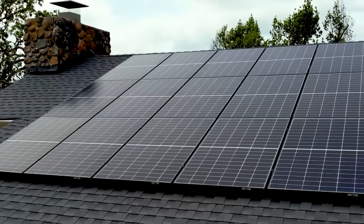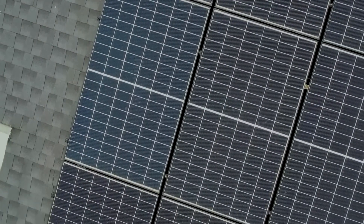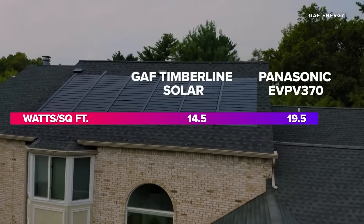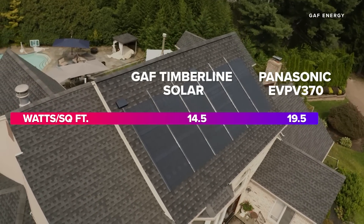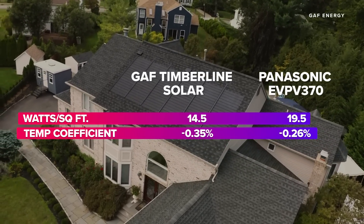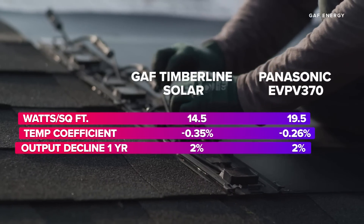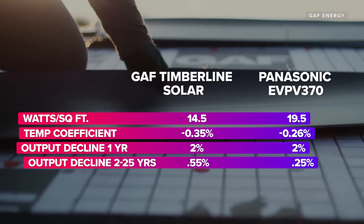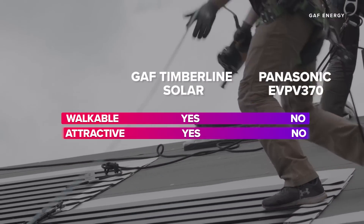It's a little tricky to define a standard solar panel to compare to, but I compared to a system I recently installed using rather premium Panasonic rack mount panels. You can see a difference in watts per square foot, but Timberline Solar might counter that with its ability to cover more roof and not have to leave the vacant walking areas that rack mount systems require. You also want to compare the temperature coefficient when you shop — this is the degree to which a solar panel loses output for every degree above 77°F. Generally, all panels lose output as they age, steeply in year one and then gradually over time down to a guaranteed minimum at the end of their warrantied life. Less quantitative benefits are the fact that you can walk on Timberline Solar and it sits down flat like a roof shingle.